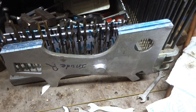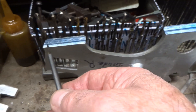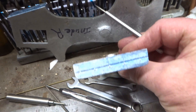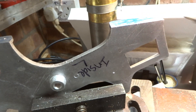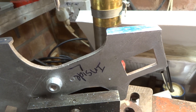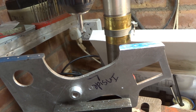Having marked out the bases of these - don't quite know what you call them - for what are going to be 4BA holding-down bolts: five on the long one, four on the bottom, and five on this one. Transfer to the drilling machine, centre-pop, then use the centre drill on the spot I've popped and follow through with an eighth-inch tapping drill so I can follow through from the other side at tapping size to tap the base plate.